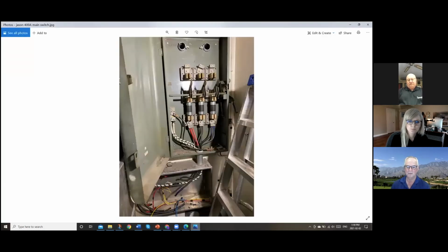So, Dave, over to you. What do you think of this service? What else can we find in this install here? Well, we could look at the grounding and bonding and see if everything's okay there. So is black tape okay? I guess he's just trying to make things safe on the system grounding conductor. We could look at the fusing and see if we figured out our fault current rating and see if a standard fuse is okay, or would we have to look and see if HRC1 fusing is required?